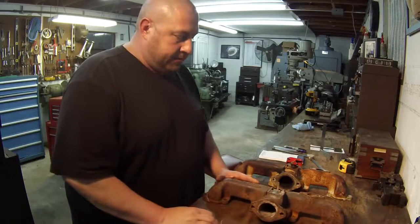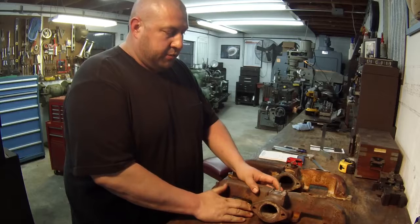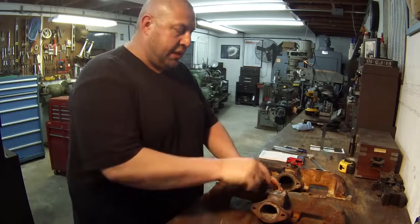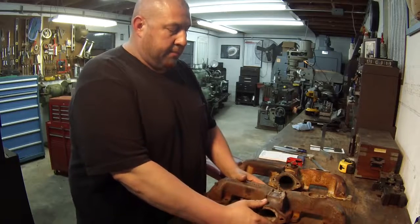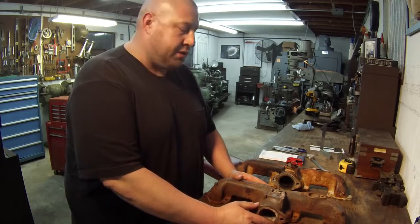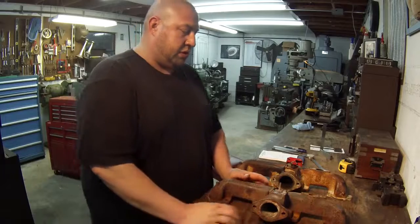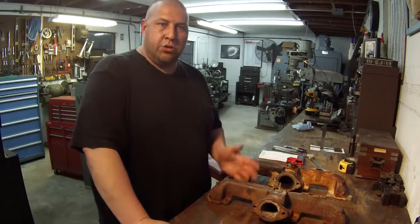When this thing is pulled down flat on the table, this flange is 90 degrees here, but that hole is not in line with this face right here. It's actually kicked up. The part will be kicked up at an angle, somewhere between 5 and 10 degrees. So I've decided to use my adjustable angle plate like I showed in the piston video.